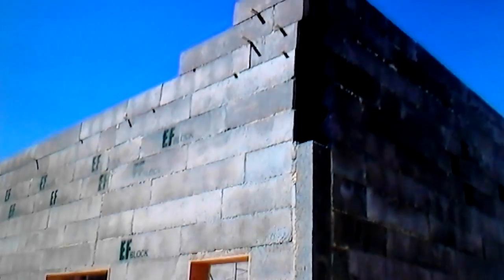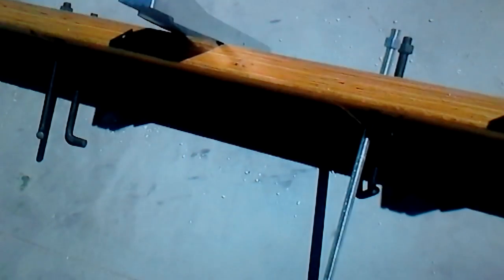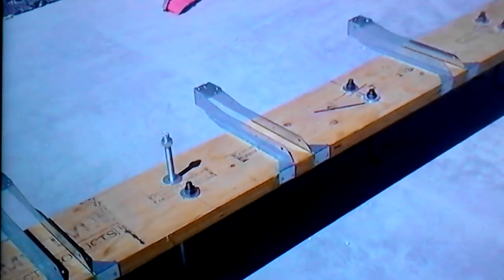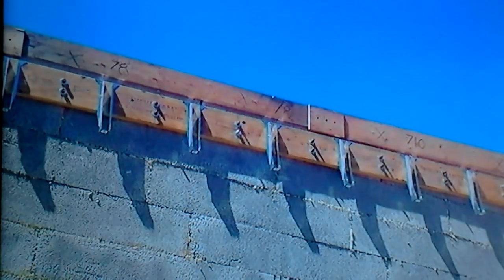You can see that string up at the top. Here's one end where you can see we've only grouted eight feet high. We pre-cut all those pieces on the ground instead of doing it on the scaffold, and there's some plywood forming we put on there — it's two inches higher than the block — so we've got a concrete cap. Here's the real trick: we did all the layout, all the bolts, all the hardware on the ground, then threw it up on the wall. Those all-thread rods go all the way through the wall and sandwich that ledger board. These are kickers we put in place to hold the ledger exactly where we wanted it, then we ran our joists and decked it.